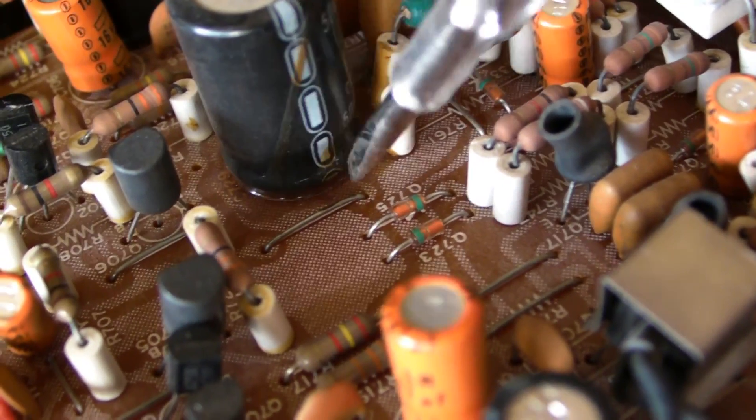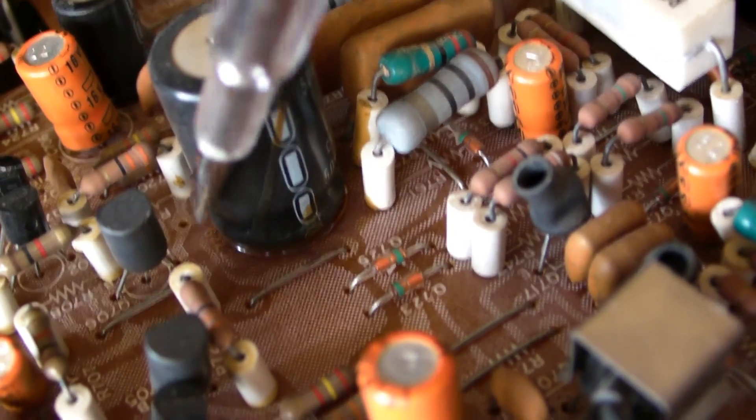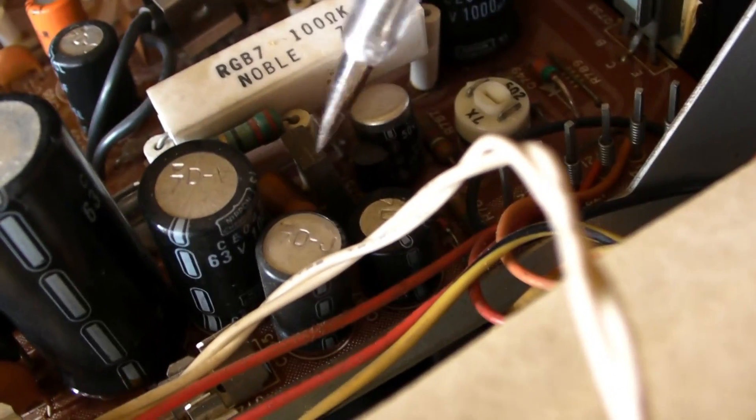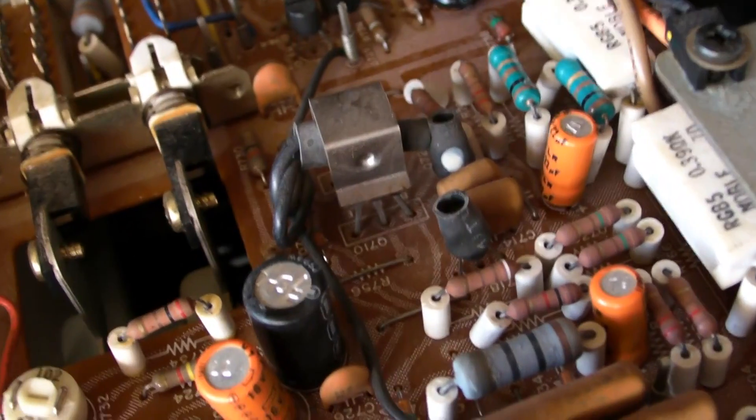I have to change those and I discovered something else on this amplifier. I will try to close it up so you can see - this capacitor is leaking. It is leaking. How did I notice that? Well, what's under the capacitor is shiny. In an old amplifier like this it can't be shiny on the bottom, because dust takes over the place. So this is leaking material - what you see here, the shiny thing, is leaking material. So I decided to change all of these capacitors from the amplifier section.